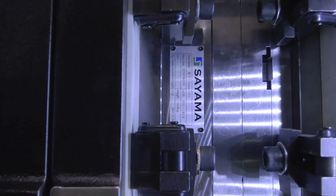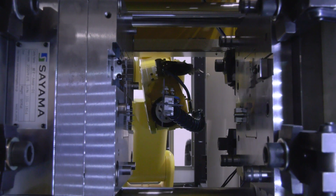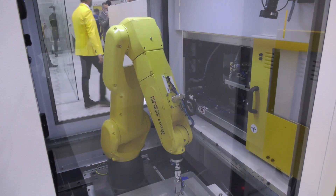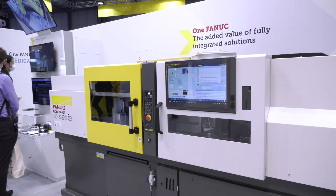What are you making here in this demonstration? This is demonstrating a metal injection molding process. This is a stainless steel based metal powder, and it's fundamentally making a medical clamp grip which would need to be sintered post-process. It's quite an unusual application — ordinarily this is an injection molding machine for straight thermoplastics, but this comes into the realms of metal injection molding where there's more specialized production of parts that need to be produced in metal, typically in the medical device industry.